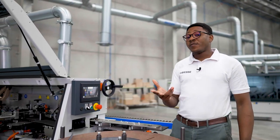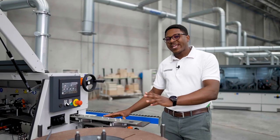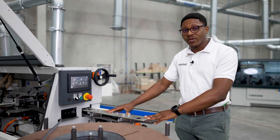As we're changing into a 2 millimeter tape, I'm going to select the 2 millimeter tape option. The first change I need to make is adjusting this in-feed fence, because it will control how much material we remove by the pre-milling unit.